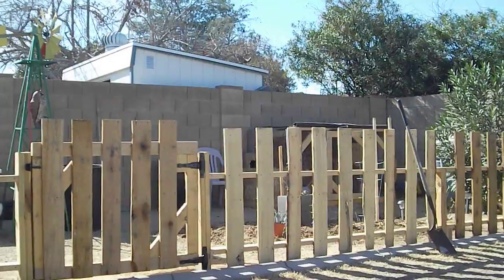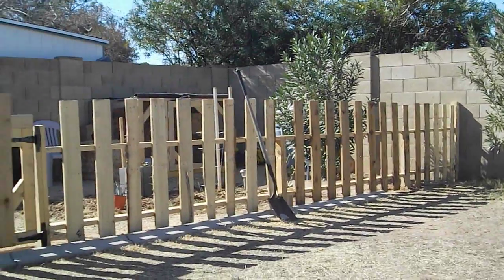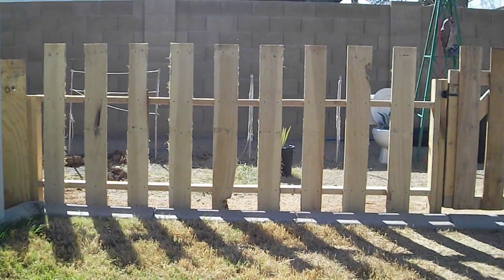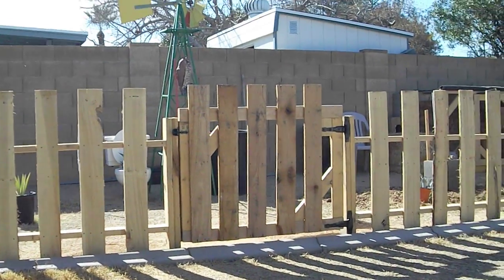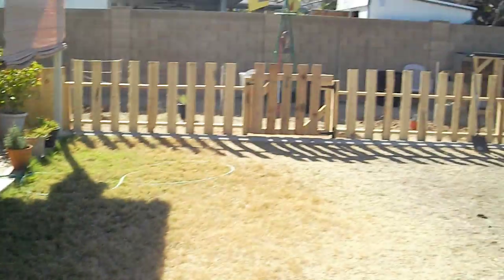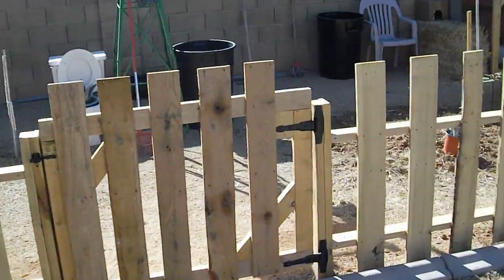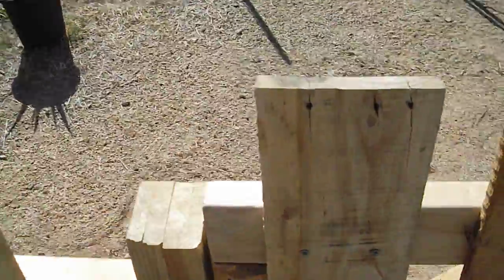The strength is there and the height. I went 5 inches between each picket, which actually ended up looking very nice and decorative. I came up with that number because it's large enough of a gap for the chickens to walk through, but yet small enough for my golden retriever to not get through and eat my chickens. I got the gate kit at Lowe's — it was like 12 bucks, just a basic kit with a regular handle.